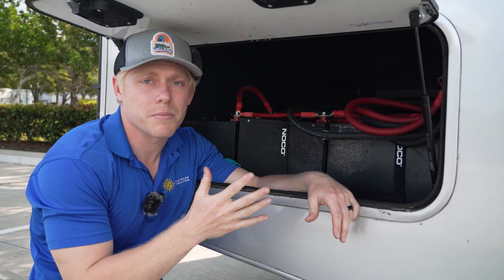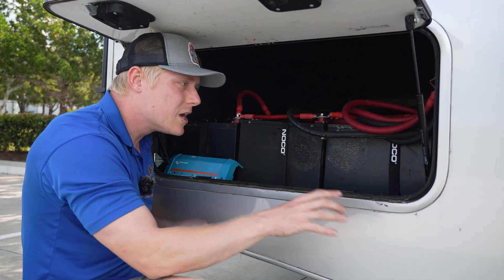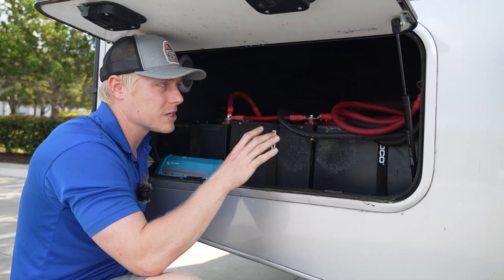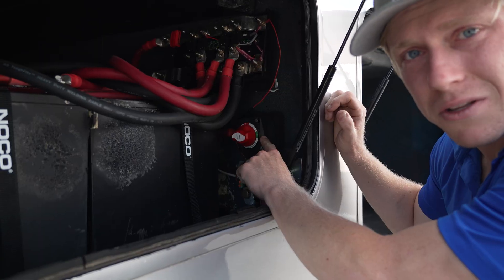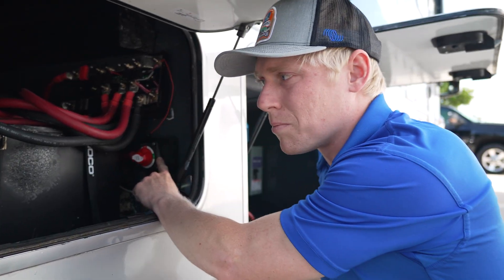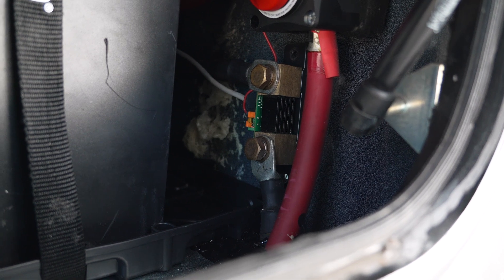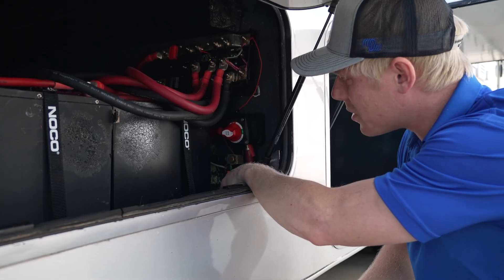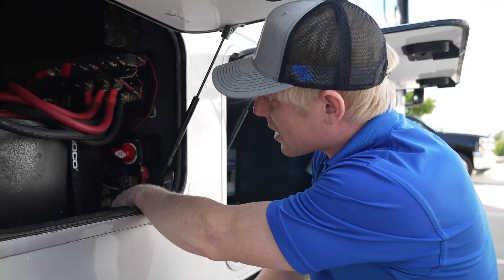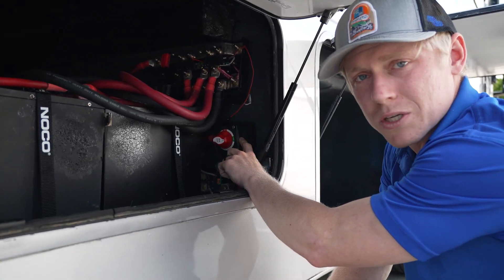Let's check out the battery cabinet, because if they've undersized the cable run going into the Lynx distributor, they're probably undersizing the switching and fuses in here too. As you can see, we've got a 275-amp rated switch even though this system can push close to 600 amps, and we've got a 500-amp rated BMV shunt. So we're going to remove this and put in a 1000-amp shunt, and we're going to double up the 4/0 runs and put in two beefier switches.